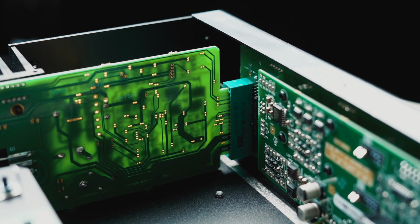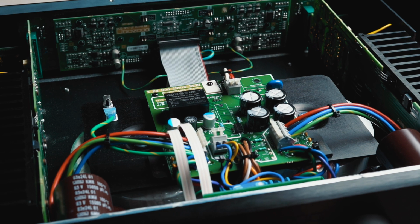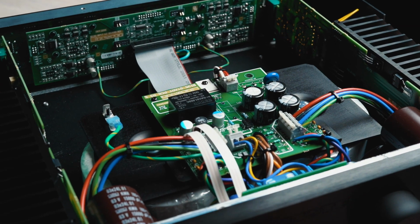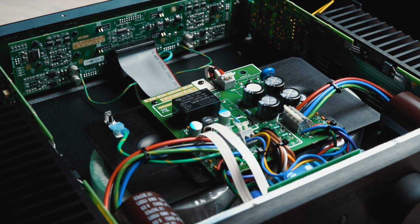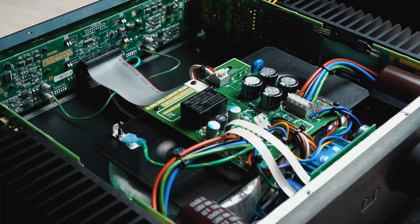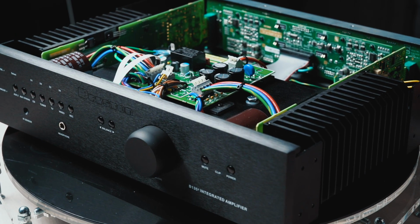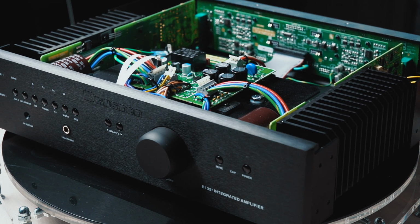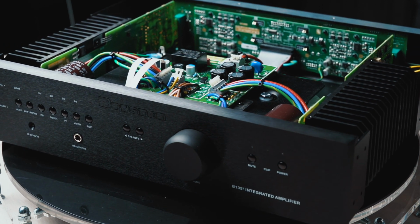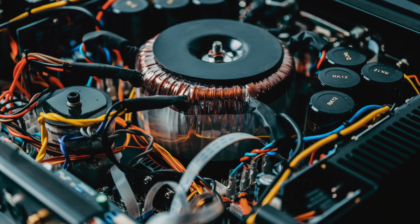Please be aware that the card is inserted into the slot from both sides. Firstly, it makes it easier to repair and replace these parts. Secondly, because there are fewer wires, naturally there is more free space inside the amplifier. Air convection is also carried out more efficiently and quickly, so there are no additional obstacles for the air and everything cools better. This is definitely a plus. There are indeed an order of magnitude fewer wires than in Hegel.